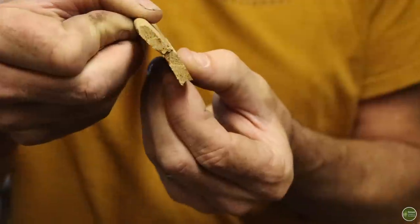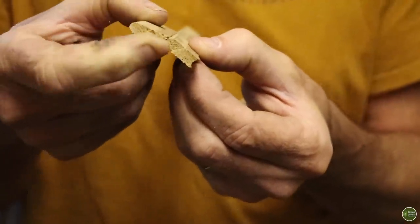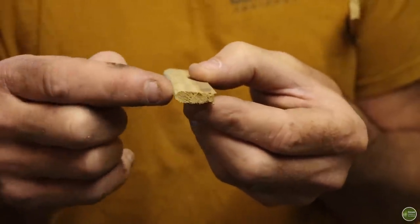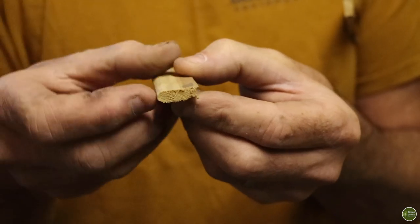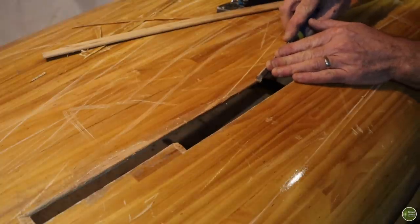As I was building it, these were glued together, and that just allows it to curve, and you've still got that glue contact in that joint in there. So I now need to shape the inside edges where I've just cut those strips out to match these. So where that bit goes against, I'm going to need to have a cove mold. I'm going to have to shape that, and on the other side I'm going to have it rounded over so that it accepts the strip that way and locks back in place again and is nice and strong.